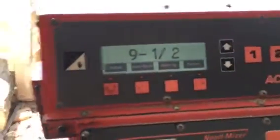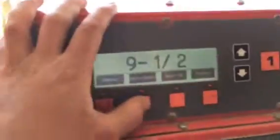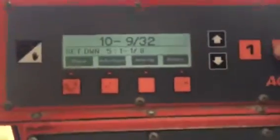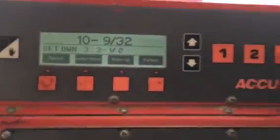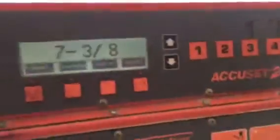The difference between pattern mode and auto down is that pattern mode knows where the bed is. Auto down just says I'm gonna go down from wherever you press me. What's nice about auto down is you can hit it, make your cut, and if you don't know what kind of board you want to take, as long as you hit auto down you can pick the head up, bring the head back, and think on it for a while. Say you're thinking — no, maybe I want to bring it here, no maybe here, no all right, two inches — okay, boom, there you go, you're locked in. It's nice.